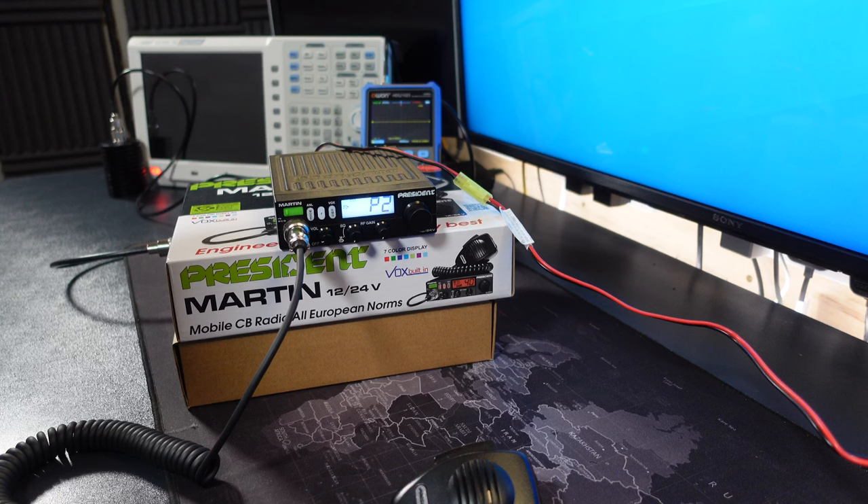Changing the setting and moving to PL mode — PL mode is FM low power adjustment — and this is the power setting that you will get when the radio is not modified or expanded. You will not get the P2 option. In this mode, my standard value is 70, which is outputting a little bit over 4 watts. So we'll just drop that one lower, which is 6F, outputting 3.91 watts.